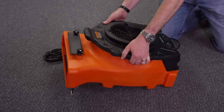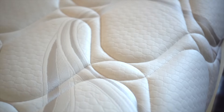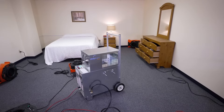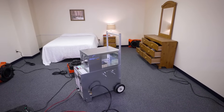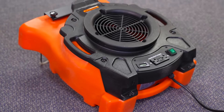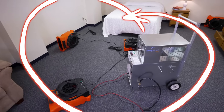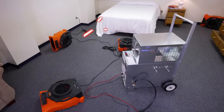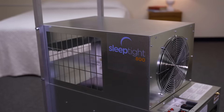Optional high temperature air movers, also sold separately, are critical to the success of heat treatments and should be placed to direct heated air towards the objects with the highest likelihood of infestation, such as the bed mattress, box spring, and headboard, as well as chairs, couches, etc. It is also good practice to place air movers near the corners of a room, directing air along the walls with them all oriented to circulate the air in the same way — for example, clockwise or counterclockwise — to create a vortex of high temperature air. A good rule of thumb is to use one air mover per 200 square feet of treated space.